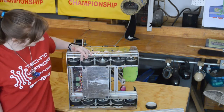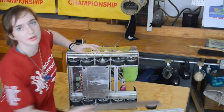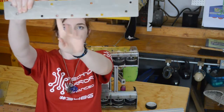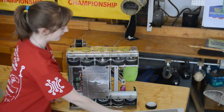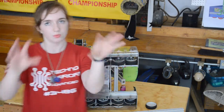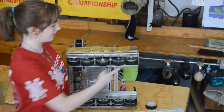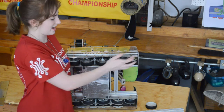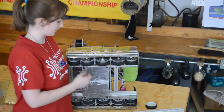Now, our drivetrain is actually chain and gear driven. The 3 central wheels, these here, are actually gears, so they're geared together. But then from the motors, there's a chain looping the exterior elevated wheel and the end of the central wheel on both sides. Now, the reason we use chain here: last year, with Pipsqueak, we used a gear to do this, so this was an improvement.